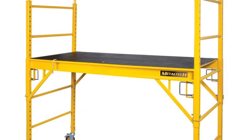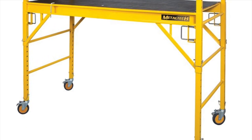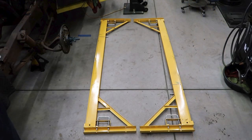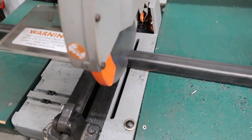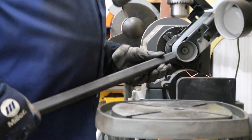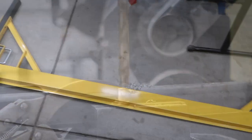Now to create a truck bed dolly. During our shop's construction, we used a metal tech scaffold that was easily put up and then broken down for storage. The scaffold side rails are relatively light but very heavy duty — they're six foot long, and that's exactly what we wanted our dolly to be. We cut some legs out of one and a half by one and a half tube steel. After cleaning up the ends and drilling holes for the scaffold quick connects, the legs fit very nicely on the side rails.